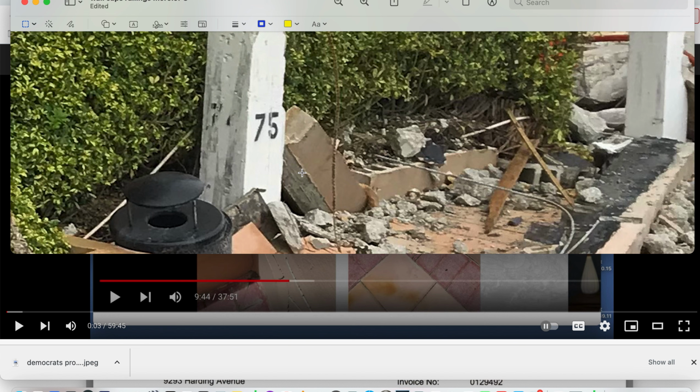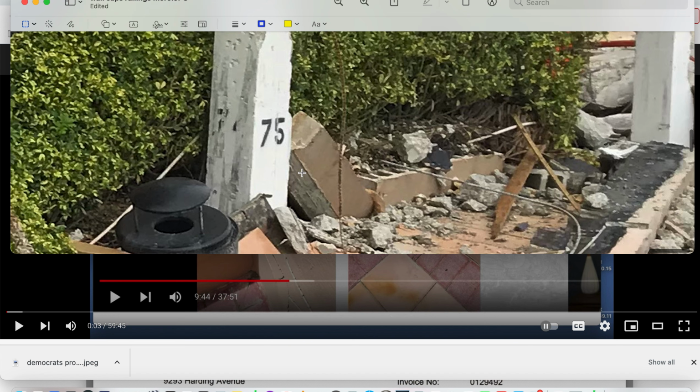Well, they had a slab added on top, if you recall. So the question I ask is, is this the structural slab, with no reinforcement presented? You think you would see some diagonal reinforcement or cross reinforcement at this point. So then I'd say, okay, well, considering it didn't just skip rebar right there, and I don't see any indication of popped rebar. So the spalling, I showed you guys that in the other videos. And this looks like the edge, the top of the deck. So I go, okay, this is the structural slab.